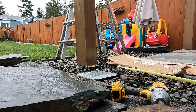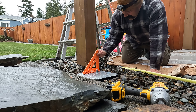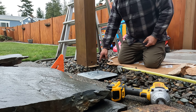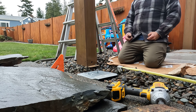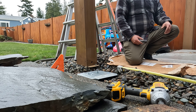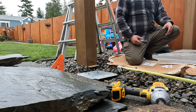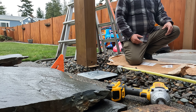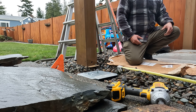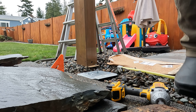Get the depth that you need, put the plate on, bolt the plate down, and check for levelness. A bit of adjustment, and that's pretty much it. Tighten it up, set the post on, drill the holes into the plate, and bolt it down. Do that on all four posts.